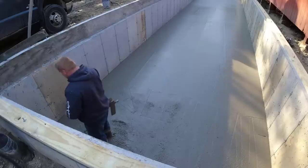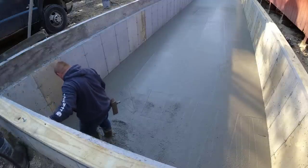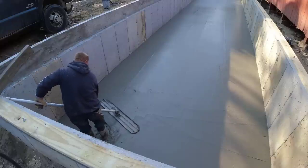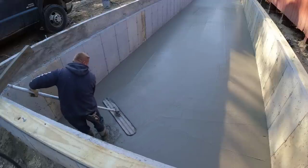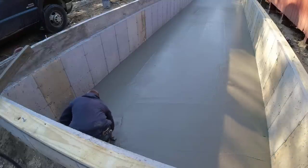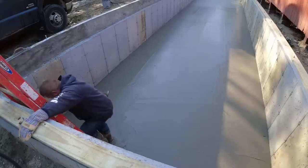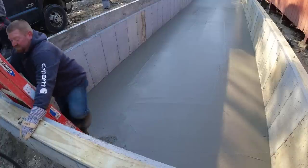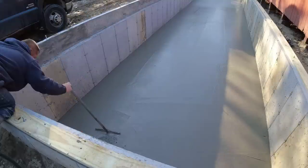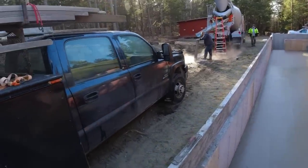Luke's been with me for well over 20 years, and Darren has been with me about 28 years — both have been doing concrete for a really really long time. They're not brothers, just good friends. Once Luke gets to the point where he can't use the screed anymore and finishes with the bull float, the last thing to do is just mag your way out as best you can, smooth that out, get yourself up out of there, pull the ladder out, and vibrate out any little ladder marks or foot marks with the screed.